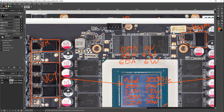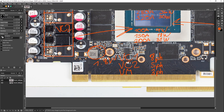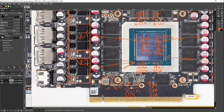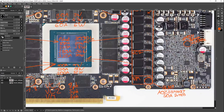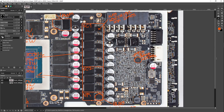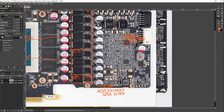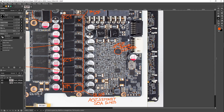There are also other minor voltage rails scattered around the board. Over here should be the PEX rail for the PCIe interface, and down here I'd assume is the 1.8 volt rail, which is a supporting voltage for both the GDDR6X memory chips and the BIOS chips. Over here is probably the 5 volt regulator, since most power stages need 5 volts to function — though there are some 3.3 volt SKUs. These minor voltages don't matter much for overclocking — if they're not present the GPU doesn't work, but adjusting them doesn't really do anything useful.